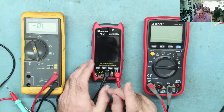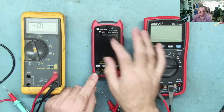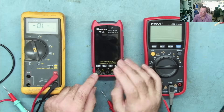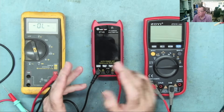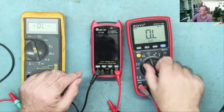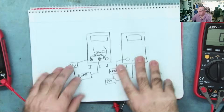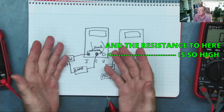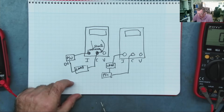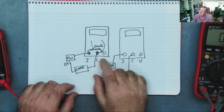You might think: whatever's monitoring the voltage internally expects a very low voltage across the shunt, so you might put too much voltage into the circuitry. Well, possibly — but that sensing circuit probably isn't even connected unless you're in current range. More importantly, the shunt resistance is so low you'll get practically no voltage across it anyway, no matter what voltage you measure. So you're very unlikely to damage the meter. That's not saying you should do this — I'm just explaining why it worked.